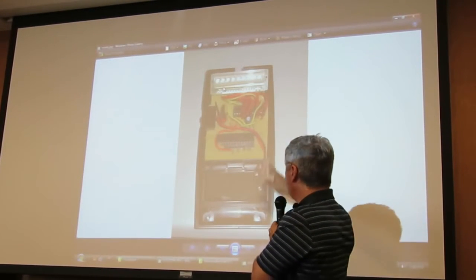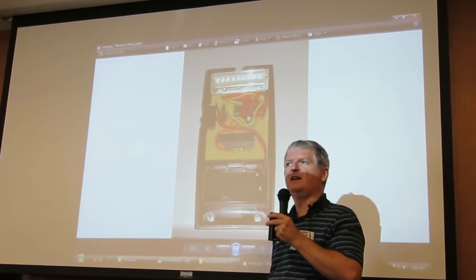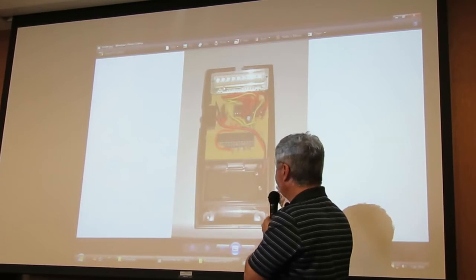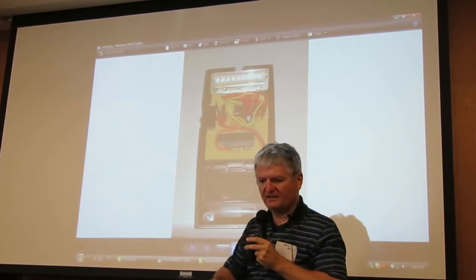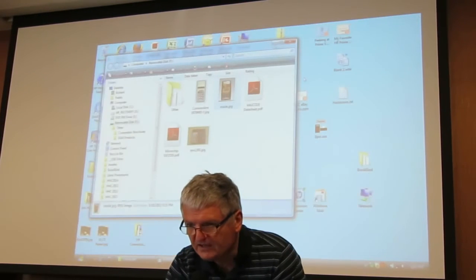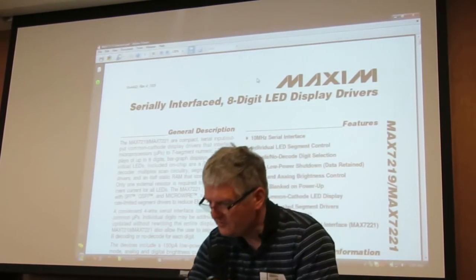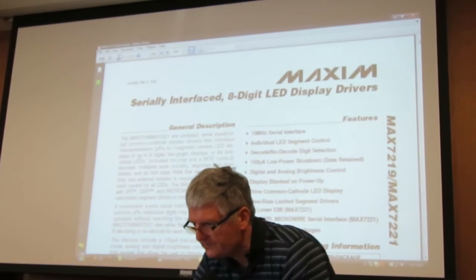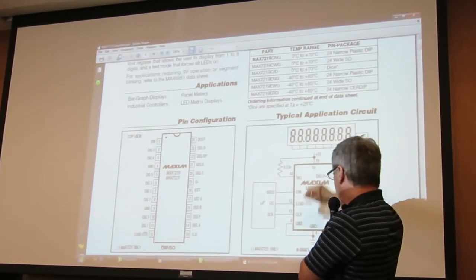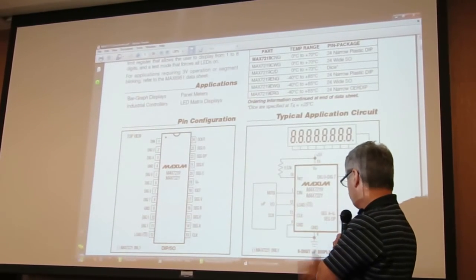That's really all there is to it — these two chips. That's a RadioShack or Fry's pre-routed PCB, so it's not a specific PCB, and that's all there is. I have the documentation as well, like for example for the MAX 7219 — at least the pin layout. It can drive eight seven-segment displays plus dots. It's fed by five volts and three input lines.